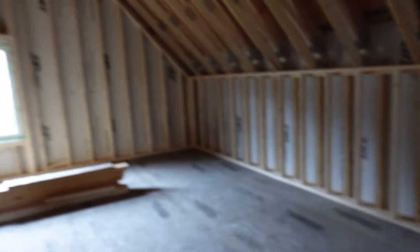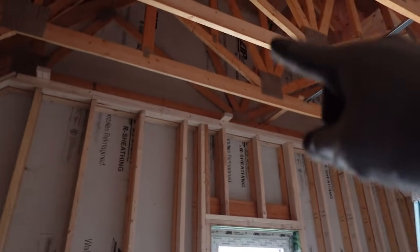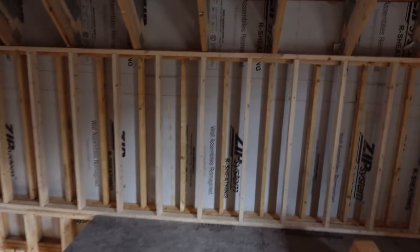Up on the second floor, no interior walls are done — just the exterior. Again there are offset studs, and some not offset. The reason some are not offset is because they're all tied together with little webbings. The purpose of that is because I have a 10-foot-6-inch to the bottom chord of the truss, plus another roughly six feet up in the webbing to the roof decking. A 16-foot wall on a two-by-four wall is a little flimsy, but with these two tied together it gives a nice stiff wall for wind deflection. The insulation netting is going on next.